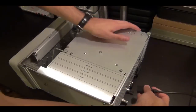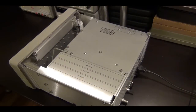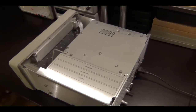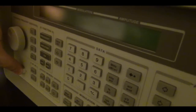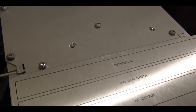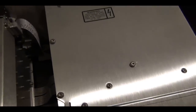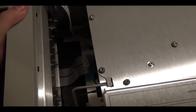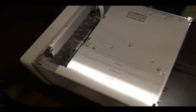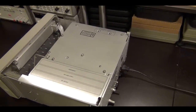I put it back together and turned it on first before completely taking it apart, just in case there's a major problem — at least there's some shielding. I plugged in the power and tried to power it on. Nothing on the display, but it's making a horrible high-frequency noise — very familiar to me. This is the sound of a switching power supply that's failed. So let me turn it back off — the switching power supply has some issues.